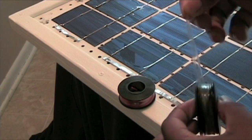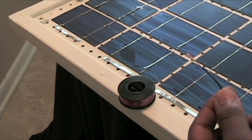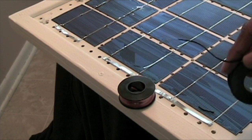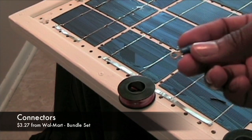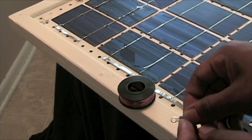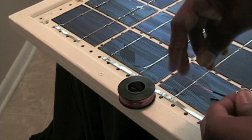I'm going to start with my negative connection — I'll take my pliers and just cut a nice length of it, wrap this around here, and try to make it as straight as you can with no loose strands. One optional thing I'm experimenting with: I got some connectors from Walmart where I place the lead inside and clamp it. This gives me a better edge to work with when soldering to the bus wire, but you can skip that step.